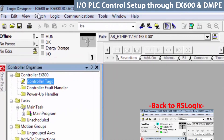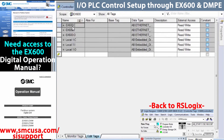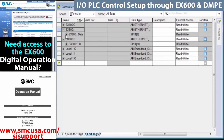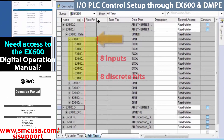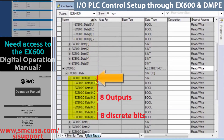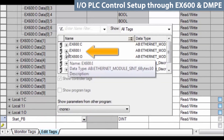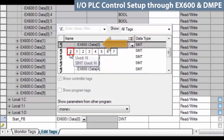Open up the PLC program. If you go to controller tags, you will see that we already have our data mapped for the EX600. Specifically, we're dealing with the digital inputs and outputs — those are going to be the first byte of input and output. Now we will first create aliases for the inputs and map the solenoid bits to match. Begin with the start push button. Select input data 0, bit 0, give it a name and then an alias.